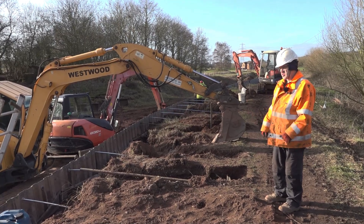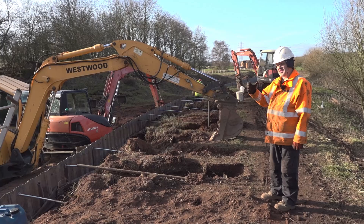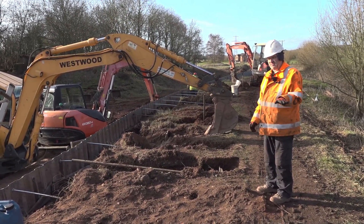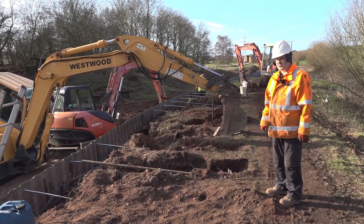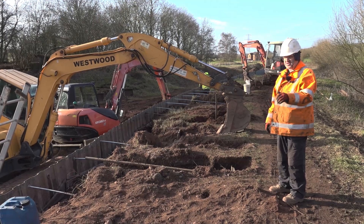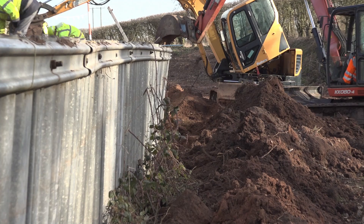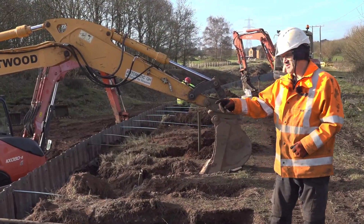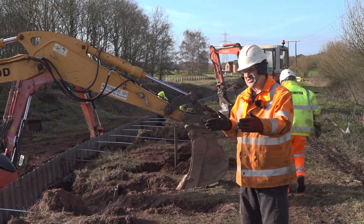The issue I think we've had here is that because the area wasn't in water, we've had soil forces compressing on the one side but with no counterbalancing water pressure on the other side. Consequently, over the time of about 20 years, what's happened is the piling has tended to work its way out.